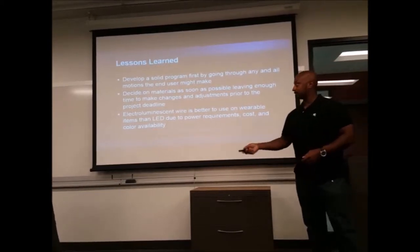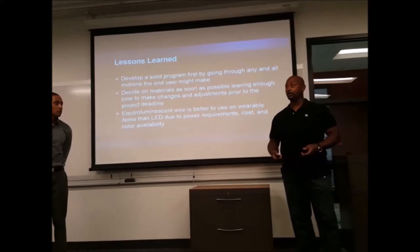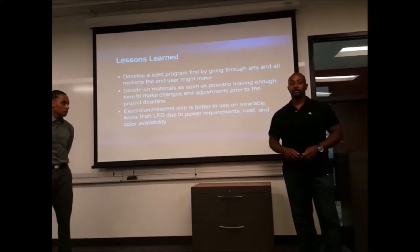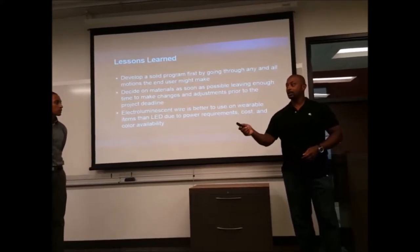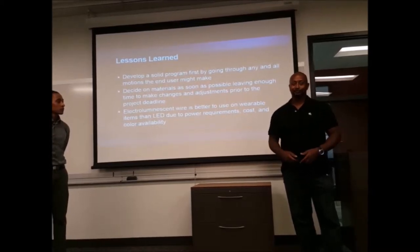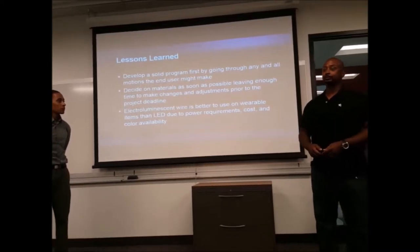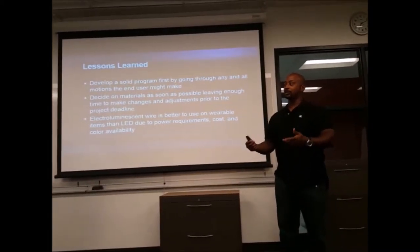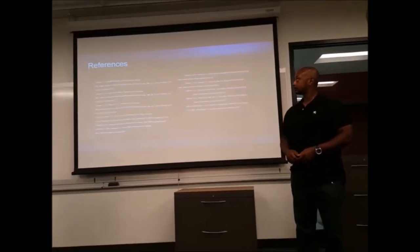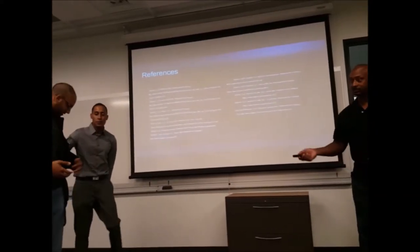We also figured out, talking about the LEDs, that was a big thing. The LEDs were pretty tough because of the power that we needed to actually run them, if we had strips large enough to show any kind of light when you're out there. And the EL wires glow pretty well at nighttime, so being a nighttime suit, throwing EL wires on there made a lot more sense, and it made more sense power-wise. So now we can go see the results of our suit.